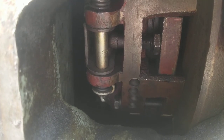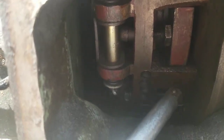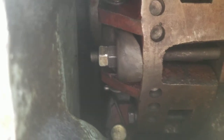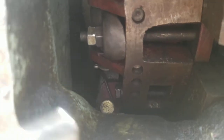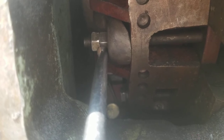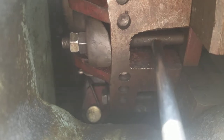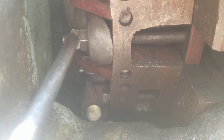Between those main clutch adjustments there's another adjustment for your PTO, so I'm rotating the assembly 60 degrees — now I'm at one of the PTO clutch adjustments. You'll loosen this lock nut here, then turn this in to bring the fork closer to the release bearing. Sometimes the whole bolt will move, so you may need a small pair of vise grips on the bolt while you turn the adjustment nut. Then retighten your lock nut when you're done.